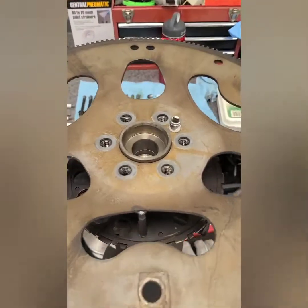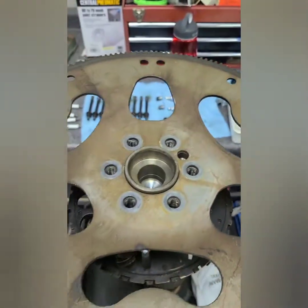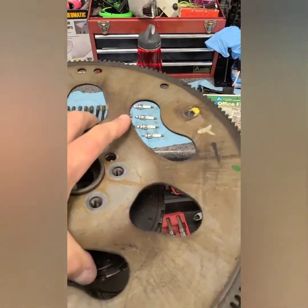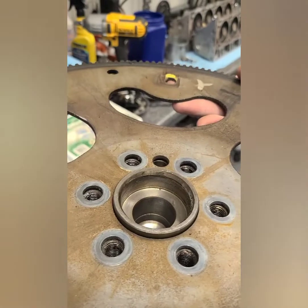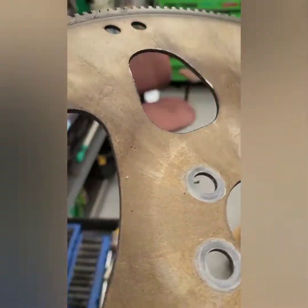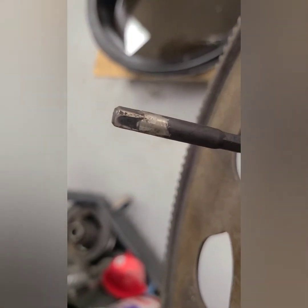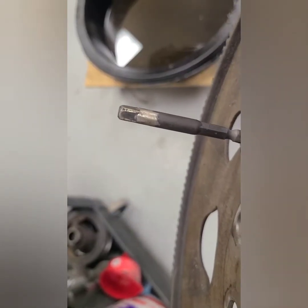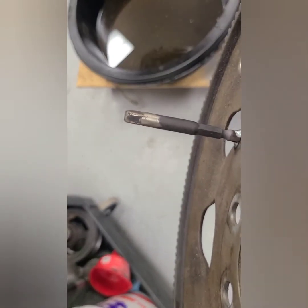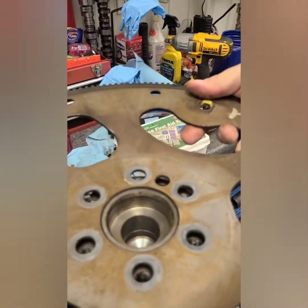Now I have an indicator that will perfectly align this. So when you take it off — I'm trying to do this one-handed here — take it off... let's see if I can do this without knocking the crank over. Let me just lift up — oh, crank's trying to go over — there we go, save the crank. And that's what you have there. I did have a little sleeve around the end that I just had to slightly grind. I put it in a drill and rotated it on a flapper wheel so that it kept everything nice and square. When you put it back on, everything slides right on in.